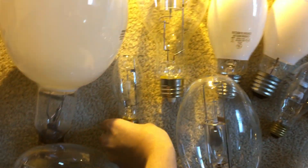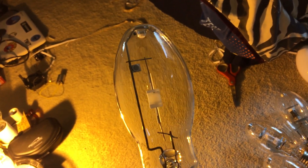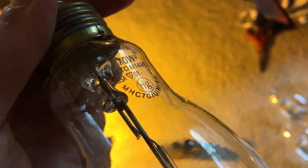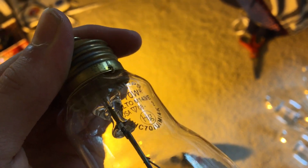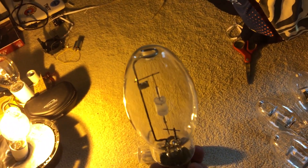This one here is a Philips 70 watt ceramic metal halide non-protected bulb, meaning there's no shield around the arc tube. It is a very nice good quality bulb — it's actually brand new. Here's the etch: it's a Philips 70 watt Alto metal halide ceramic bulb. It uses the M143-E ballast. There's the dimple on top for support for the arc tube.